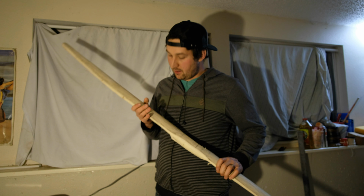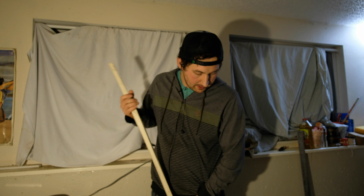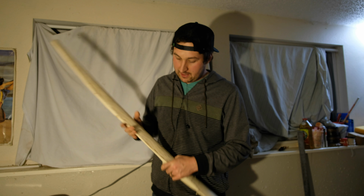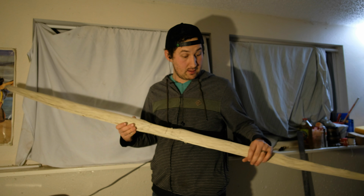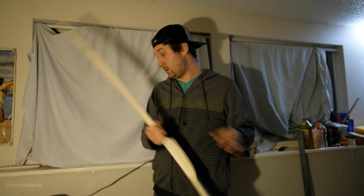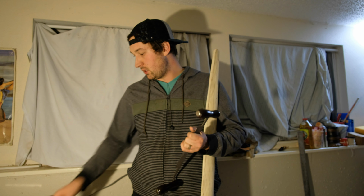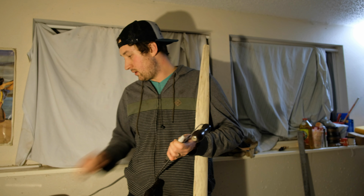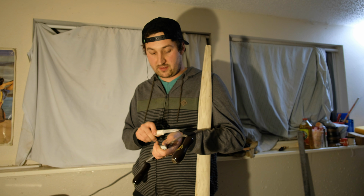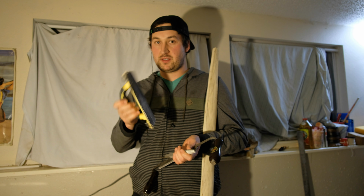All right, I'm going to bring this down to a floor tiller now, and I'll get it to bend a little bit against my knee before I cure it for a couple more months and make sure it's ready to be fully tillered. Here are a couple of the tools I'll be using. Got myself a 9-inch draw knife, a round rasp file, a sort of dull kitchen knife, a smaller one, I'll use that as a scraper, and a drywall sander.